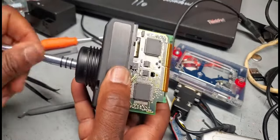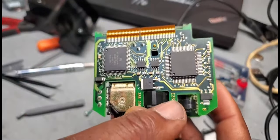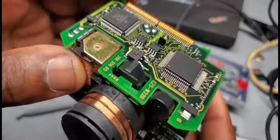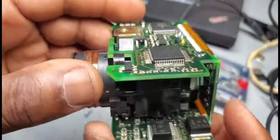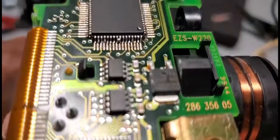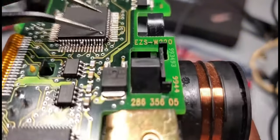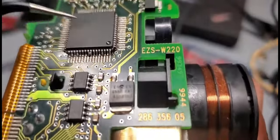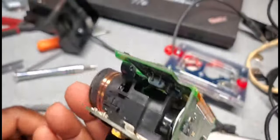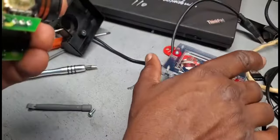This job takes like 10 to 20 minutes to finish if everything is okay. This is the module that you need to read. But if you notice here, as I look at it, it looks like somebody desoldered this one and soldered it again, and it looks like they messed up some stuff here. You see this solder — it's accumulating here and joining two pins together, which means it shorted out the whole circuit. So our problem here now is that this one is not going to work. I'm not sure if the whole piece is messed up or not.